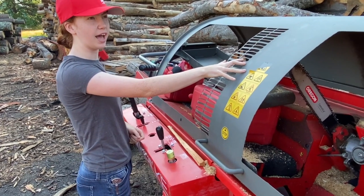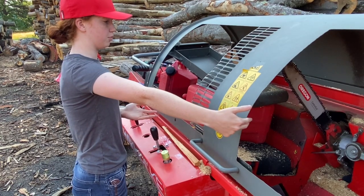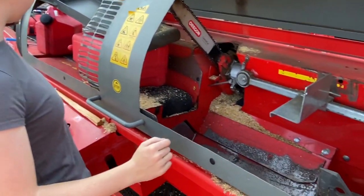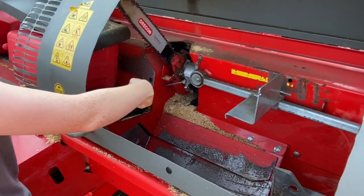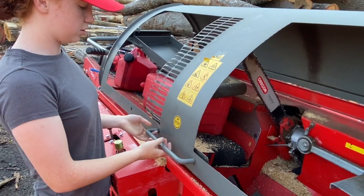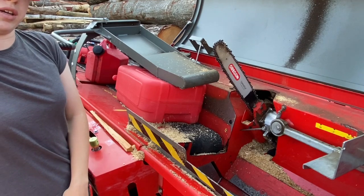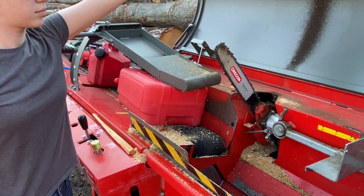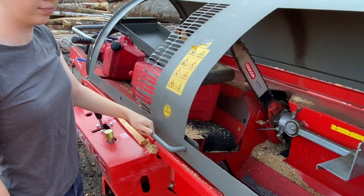Well, I would be standing here so I can't reach directly to the saw. To get to it I'd basically have to come from that side or be all the way over here. For the splitting, I can't reach the manual splitter. Our policy is that when you need to reach in, you open the door — and that stops everything, so nothing can move. It's designed so that when you open the door it shuts off all the hydraulic controls.